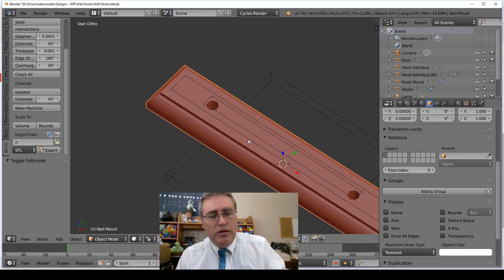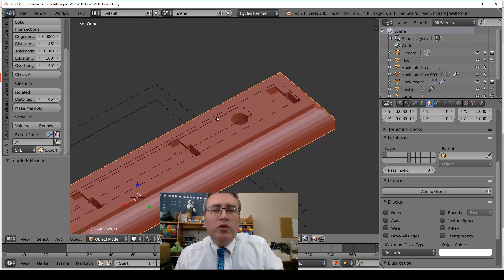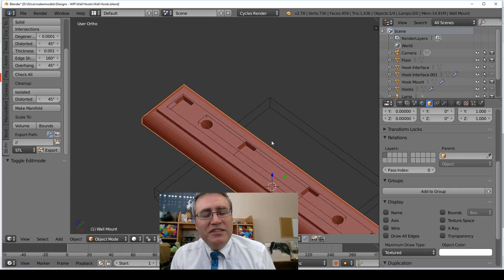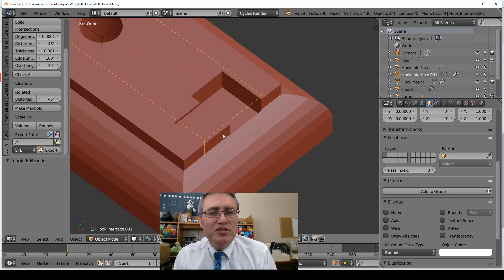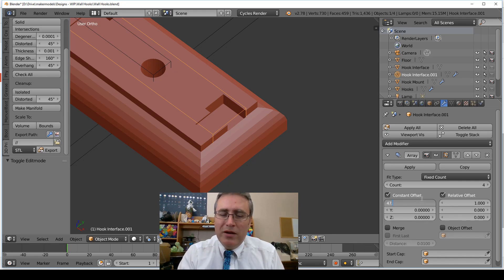Let's put this back to bounds and come out — you can see those holes now in there. These holes were designed with 45-degree angles so they would print well on an FFF 3D printer. However, it wasn't until after printing that I noticed I made a little boo-boo: this last one goes just a little bit too far over the edge.